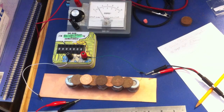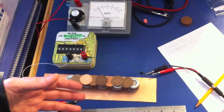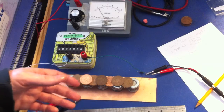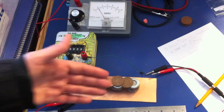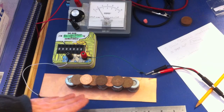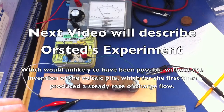Packing the stacks in parallel six deep gave us a much lower internal impedance than a single stack. With hundreds of these you could get really high currents — and that's exactly what they had to do back in the 1800s when they built these batteries. They needed loads of cells because of the massive internal resistance on the first voltaic piles made from zinc, copper, and salt as the electrolyte. They were very inefficient. It was 36 years later when the Daniell cell came along that batteries started to become like the modern versions we have today. That's it — I hope you found that useful.